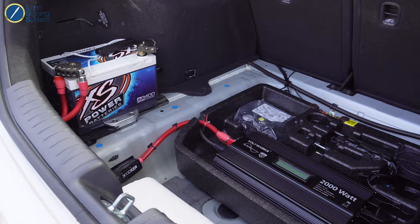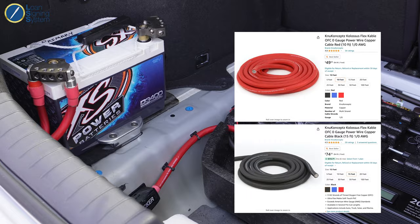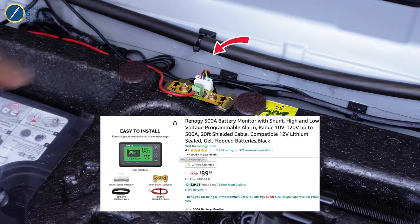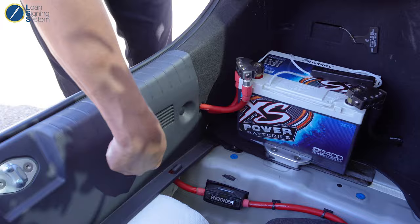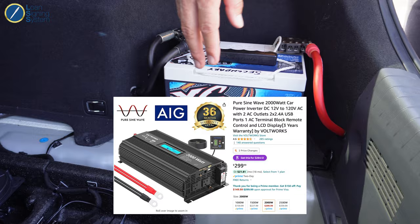That battery on the left gets plugged in directly to the actual inverter, and then that first battery gets wired directly into the secondary battery. Red to red, black to black. The whole system itself is run through the shunt right up there, which is linked to the battery monitoring. See how the red line goes all the way to the red here, and the black goes all the way to the black — this monitors the battery up front. See these two things here? One goes inside and connects up there, and the black also has two — one going directly into the inverter, another going to the second battery. It really isn't that complicated when you break it down.